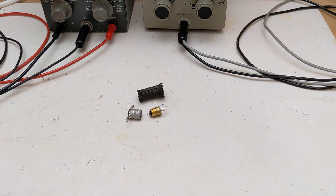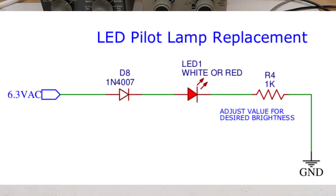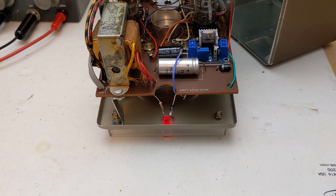You can wire an LED in yourself. Use a current limiting resistor as well as a diode, as the 6.3 volts AC may exceed the peak inverse voltage of the LED, which can be as low as 5 volts, and damage it. A suitable circuit is shown here. On my Heathkit VTVMs, I removed the old bulb and socket and soldered in a red LED with a 1K resistor and a 1N4007 diode. This provides a red power indication, similar to the original, which used the white No. 50 bulb behind some red plastic film.